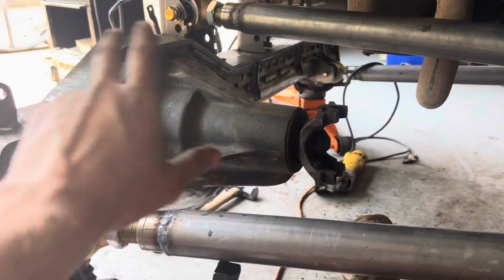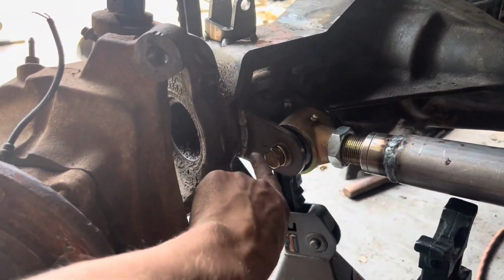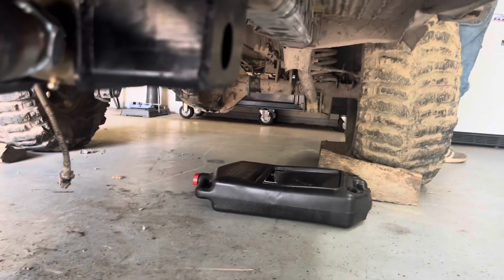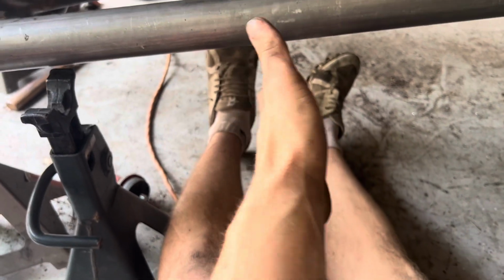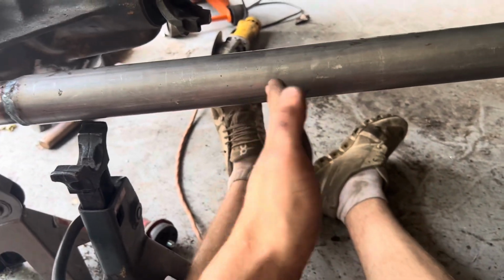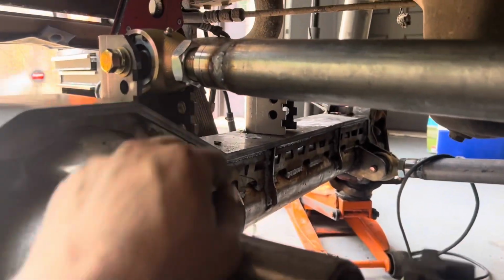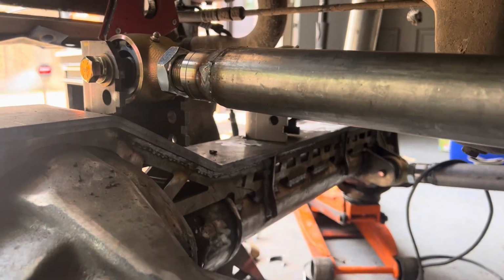But you just gotta line everything up so that it'll be top dead center, and then you're gonna measure from one spot on this knuckle to straight back, and then you make sure that your wheelbases match, so that way your axle is not twisted like this, because that'll cause uneven wear on the tires. You want your axle to be dead straight this way, but also dead straight in the middle. So we're again just lining up that string with the mark we made earlier.